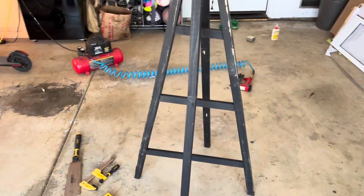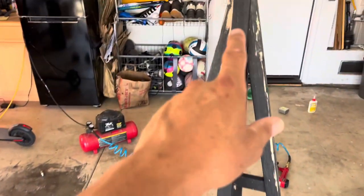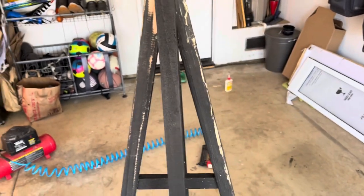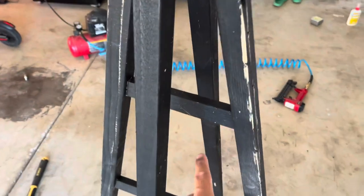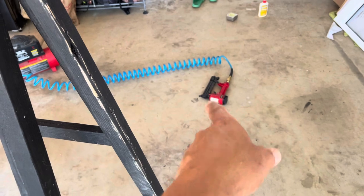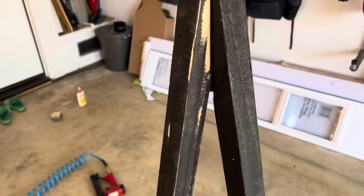I went ahead and stood everything up, making sure that these legs are straight and that the distance between each leg is equal. I clamped the top — I did have to sand it down because it had been so hot in Northern California that it actually melted to the floor in the garage. The braces I've been gluing and then air nailing underneath with an air nailer, but you could use screws or finishing nails. Now that we've got everything measured out, the next step is to attach these legs — I'll run a bead of glue and then air nail it in.